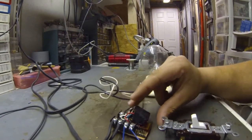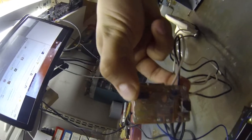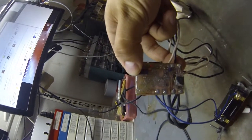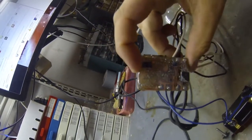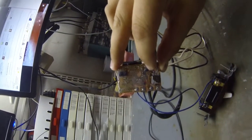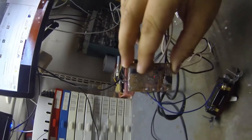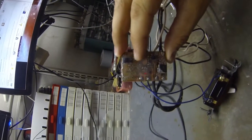On the bottom side, the bottom chip is a triac — 15 amps, I think 600 volts. It's all covered in glue so nothing gets shorted. This is a triac optocoupler — that's what turns this on and off from the PIC. This is a PIC 24HJ12GP202.